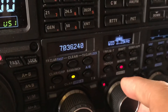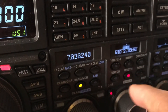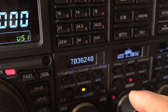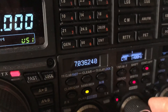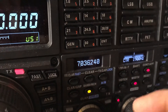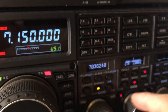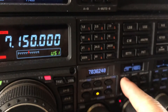Width — I just want to go down to 1.5K. I use that sometimes if we've got adjacent interference. Contour — I find that around 1900 hertz is usually the best place for that on sideband if I'm trying to pull somebody. For CW, somewhere around 200 or 300 hertz seems to be the magic spot. Really don't even need it on this guy here — he's not buried down there. The microtuner just helps.